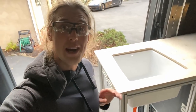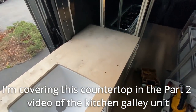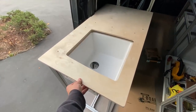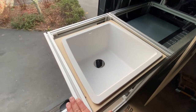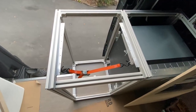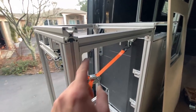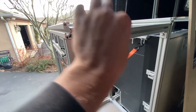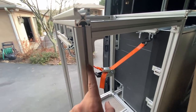Full day's work here and we have finally completed my newest invention: the sink satchel. This is kind of what it's going to look like when it's installed. Obviously this is still the template, but we got ourselves a hanging sink. Let's take the countertop off. Now we have the sink sitting in the wooden ring I showed you guys — the top of the sink basically sits flush with the bottom of the countertop. And then the magic is actually all of this snazzy stuff in here. First things first, we have the front mount — this is literally just an 80-20 extrusion that was slid down one inch, since we have half an inch of plywood and half an inch of sink.